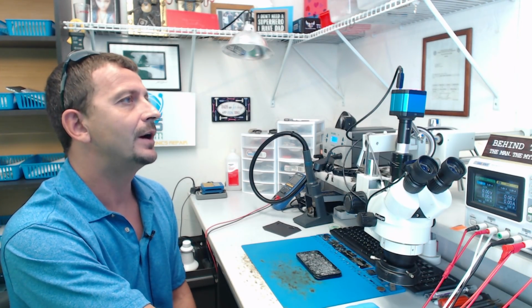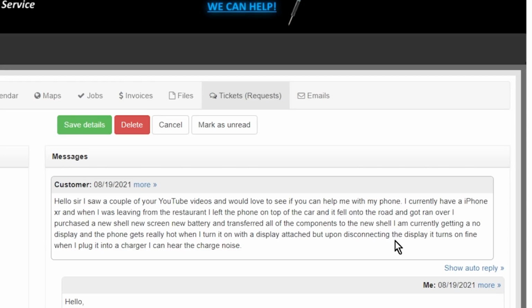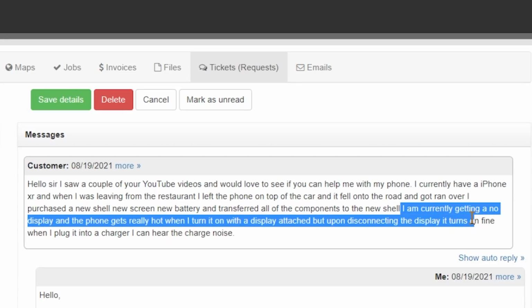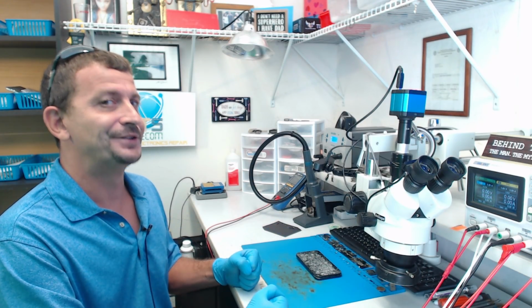Hello sir, I saw a couple of your YouTube videos and I would love to see if you can help me with my phone. I currently have an iPhone XR and when I was leaving the restaurant, I left the phone on top of the car and it fell onto the road and got ran over. That is terrifying. I purchased a new shell, new screen, new battery, and I transferred all of the components to the new shell. I'm currently getting no display and the phone gets really hot when I turn it on with the display attached, but upon disconnecting the display, it turns on fine when I plug it into the charger. I can hear the charge noise, and so is the third time a charm.